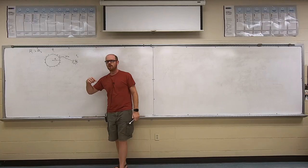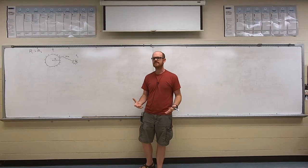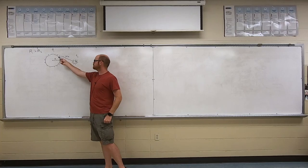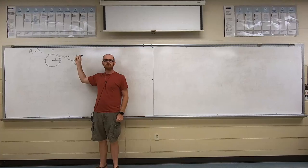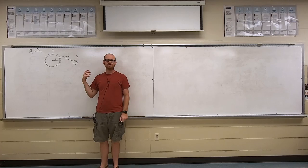Okay? Our logical process in which we thought about conductive materials, we talked about conduction of charges, the fact that charges will move and try to spread themselves out as evenly over a surface as possible, also applies to the distribution of charges on different surfaces that are attached. We won't consider the surface of the wire. It's just like a bridge from getting from one place to the other. So we touch the wire to both sides, take the wire off. What has happened? Well, the charges have distributed themselves evenly over the surfaces.